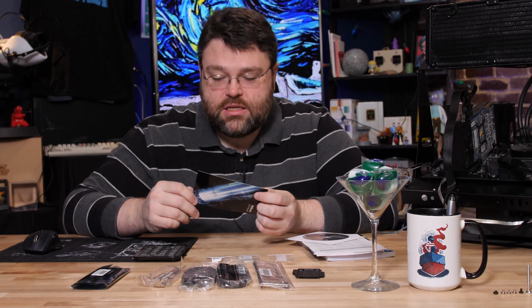Now, even though the VRM power situation on this motherboard is a bit limited, it does have dual 8-pin connections. The second 8-pin connection is optional. You don't have to run with that, but you can, especially if you have a lower wattage power supply, or maybe you want to ensure that you've got clean power delivery to your CPU, maybe flat cables can't carry as much current or whatever. One single connector that can deliver 20 amps to this motherboard is all you need. If you're not sure that connector can deliver 20 amps, you could use two, but again, like I say, entirely optional.